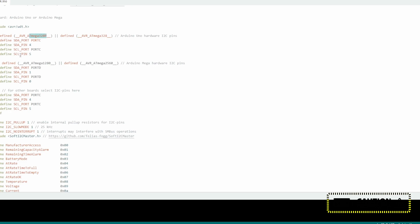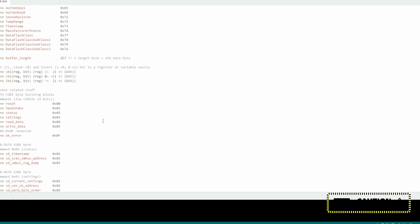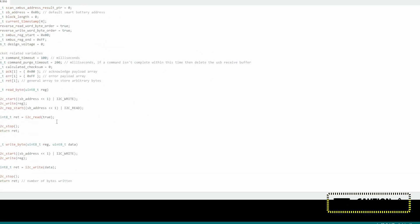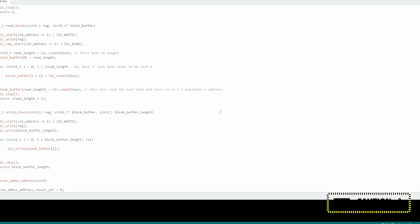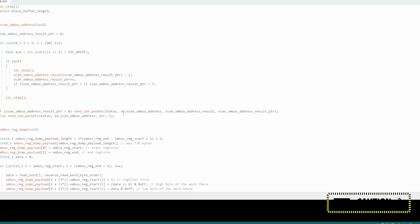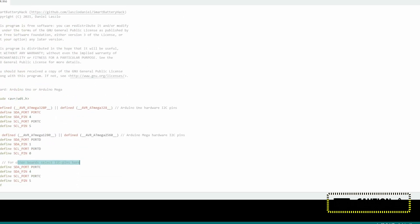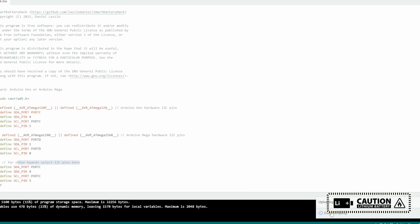You can find the chip here — ATmega 328P. The data pin is four (A4) and the clock pin is five (A5). You can also use other chips if you want — just define the Arduino board here. You can edit the ROM size or any other settings, though I am not going to edit anything. After that, click the Upload button to compile, and done uploading.